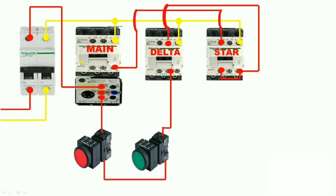But as we know, our main contactor needs to operate permanently. For operating it permanently, we need to give it a holding supply. We take one supply from the main contactor A2 terminal and give it to the NO terminal of the main contactor — as we always do when giving holding supply. We can take the holding supply from the NC output or from the NO input. So we take the holding supply from here and connect it to the main contactor NO terminal.